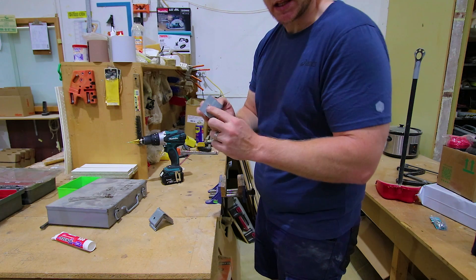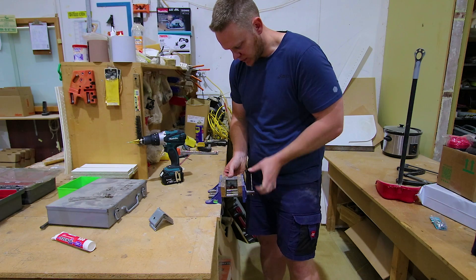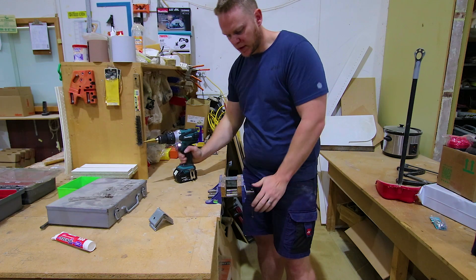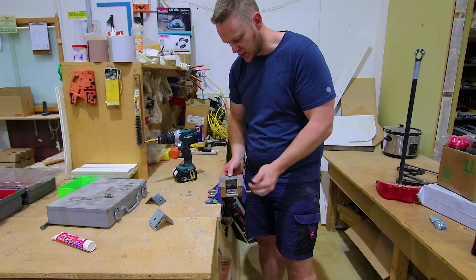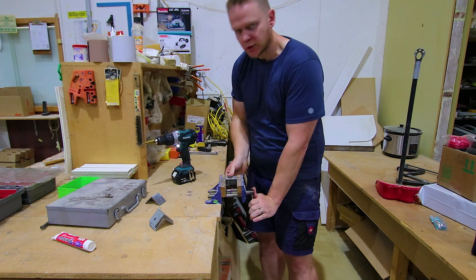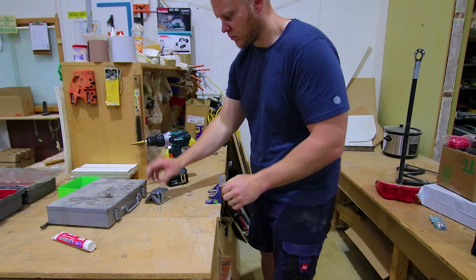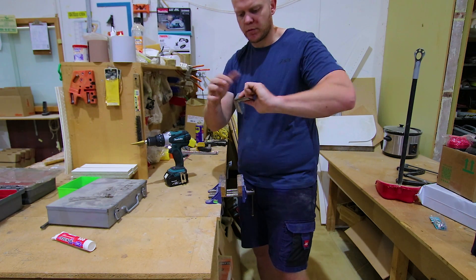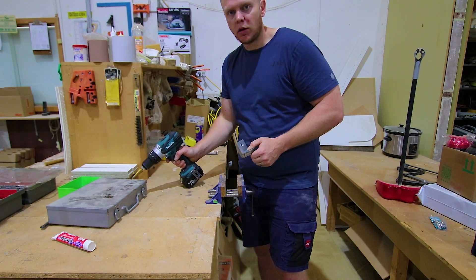As soon as you drill through you always get a little bit of burring on the back edge, so I'm going to put the step drill back in just quickly and just touch the back edge — gives a little bevel on there, takes the burring off. Perfect. You don't have to worry about scratches or cutting yourself or anything like that. Takes two seconds. That's all the brackets ready to go, apart from one more hole. Now let's drill some holes in the solar panel and go from there.